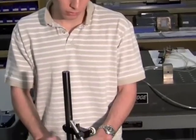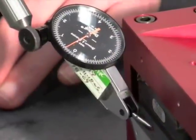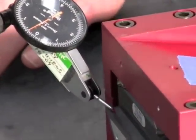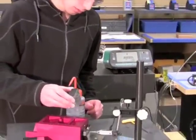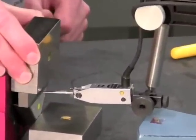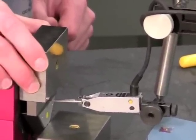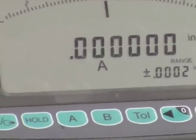Eric's doing the final alignment here. Okay, here we are doing a quick stiffness test — Eric's about to load the nose of the spindle. We've got an electronic indicator referencing the nose of the spindle, and then it comes back to zero. Perfectly.